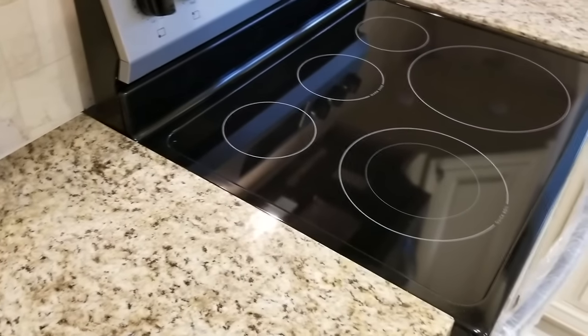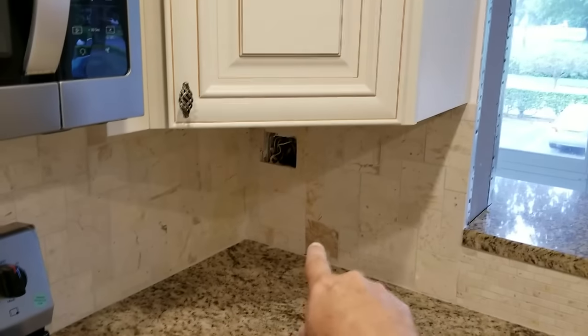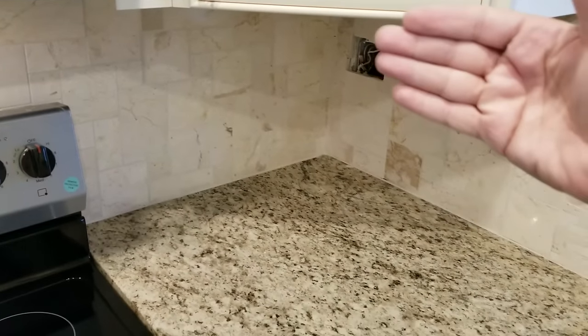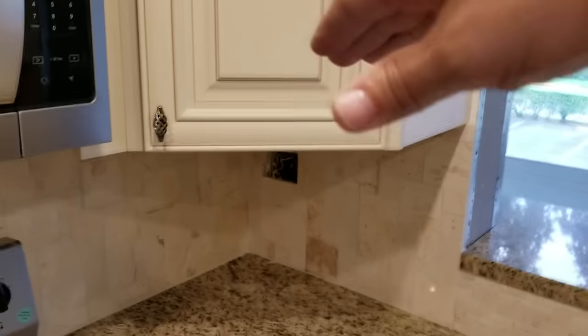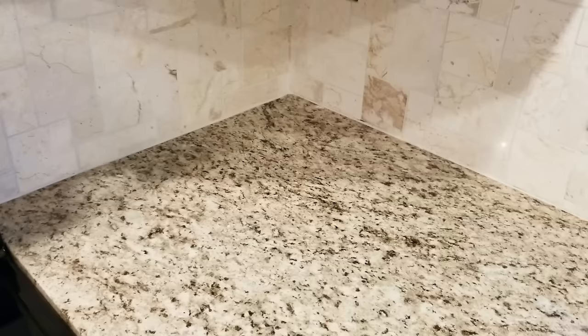The problem is all of these builders have people designing the lighting in your kitchen who have absolutely no idea what they're doing. The only place we're going to see a little bit of a shadow is in the back end of this corner cabinet — and that's unavoidable no matter what you do, because the cabinet comes out so far. Even though we have one light way over here and another way in the back, it's still not enough to overcome the angle and the distance the light is traveling. But even then, it's not completely dark like some of the other kitchens we just showed you.